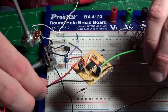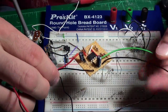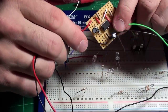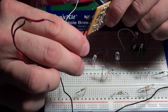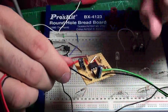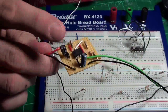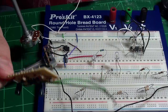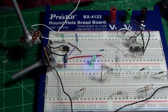Just in case you're curious, this right here is the strobe circuit I built — it's this exact same circuit, nine volts, set to run a white LED. You're noticing the extra capacitor in here — this extra capacitor stops signal leak out of the circuit. It's a 100 microfarad 16-volt capacitor, a higher voltage than the one used for timing because it's seeing the full 15 volts the power supply can provide. I'm going to put those circuit diagrams up on the video as well.